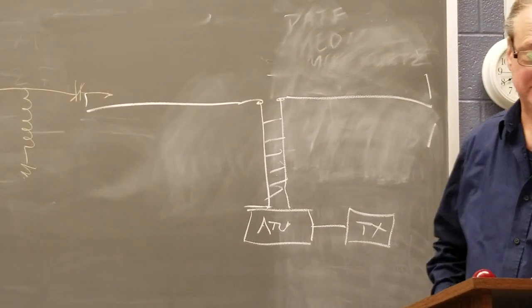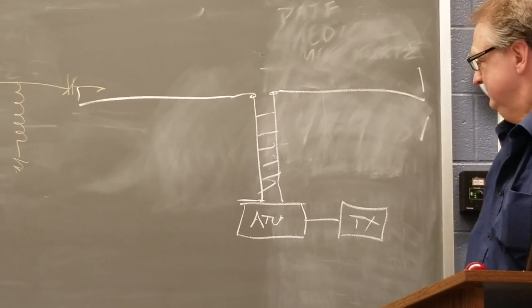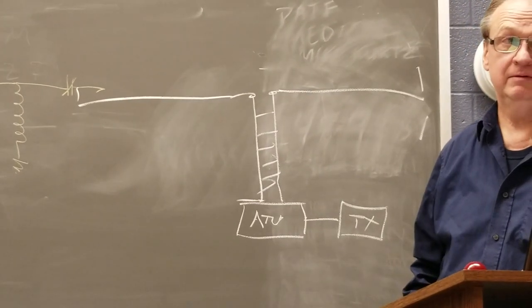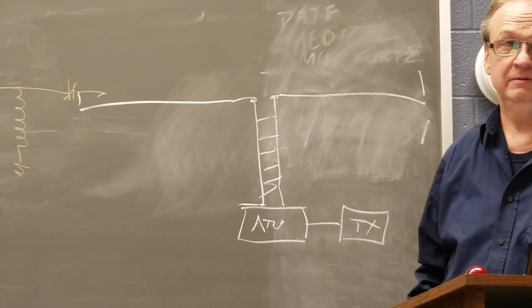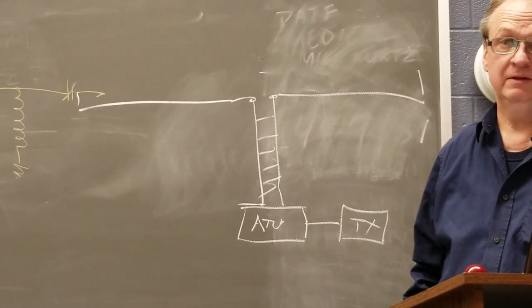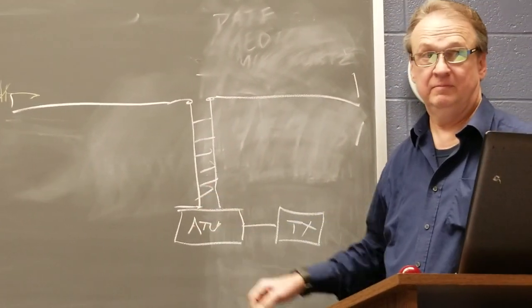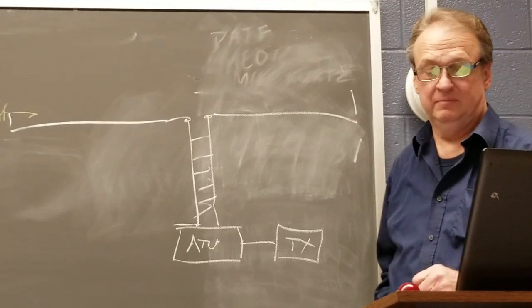My coax length is 8 inches. The ATU and everything else after that is the antenna. People don't realize that. They say, oh, it sucks it all up. But when you run ladder line, number one, anything coming back, if it does, is balanced line. You get no RF. You're not going to light up the toaster.